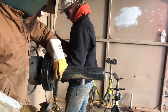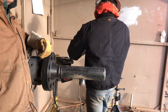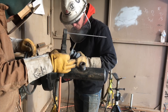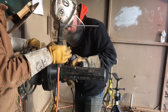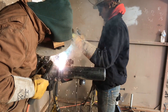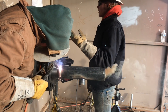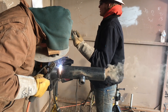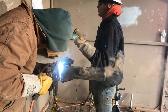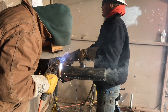I'm going to start this tack right here, and Jed will hurry and grind our starts real quick. Later on in this video the phone actually winds up dying, but I think you guys get the basic idea of what's going on. You're going to want to make sure your stuff stays square — check it with levels quite often. Practice this stuff and make it happen, because this is what's making you money. If your stuff goes out and doesn't fit, it's because something went wrong with your levels or your measurements, or you just plain messed up — which happens to everybody. Check your levels, check your square all the time, make sure your stuff's fitting good and everything's measured right.